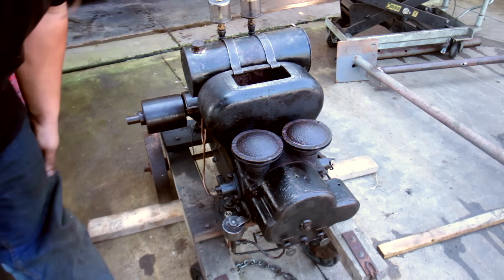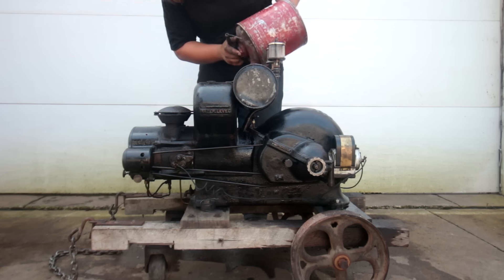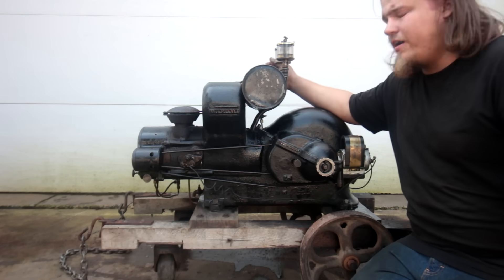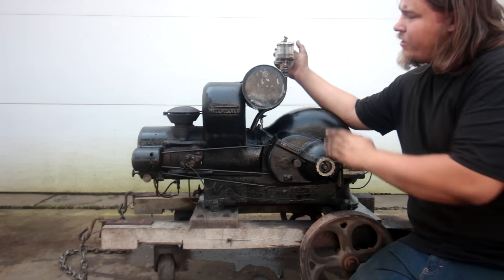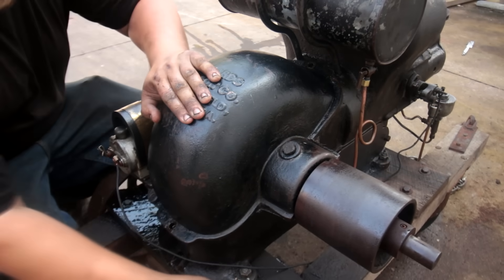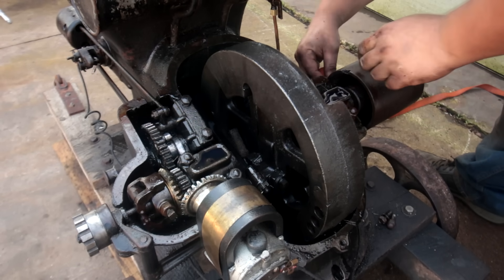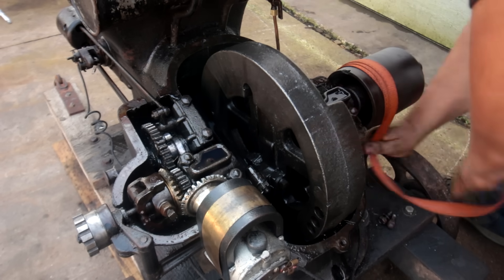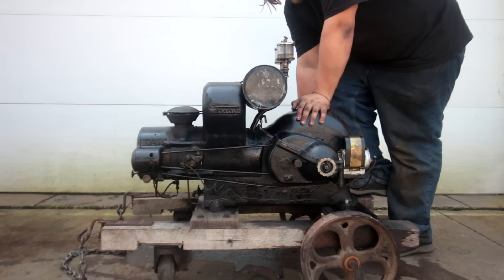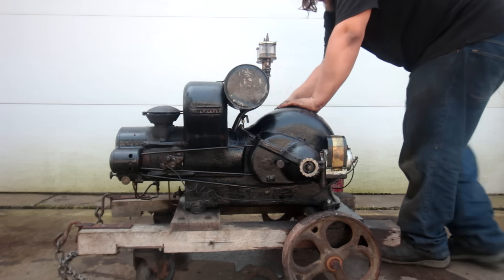I'll go get some gas and we can fire it up. You always want to have the drip rate set pretty high on an Edwards because the rod bearings are lubricated by the same drip oiler as the cylinder - I always have these excessively dripping so I don't spin a bearing. The way you start an Edwards is they don't have a crank and you can't grab the flywheels. From the factory you wrap a leather belt around the pulley. I use a cut-off ratchet strap - wrap it around tight enough and it bites without even needing a pin. One pull should start it. That was one of the marketing gimmicks: easy to start, no cranking required.